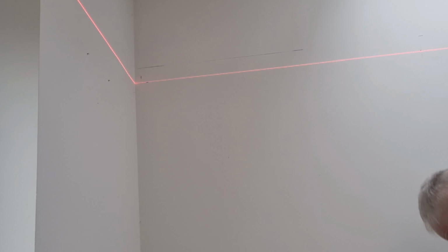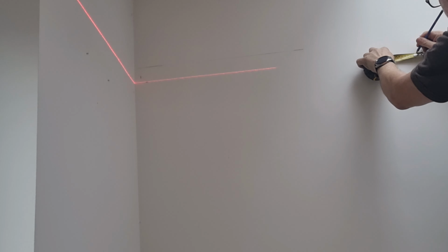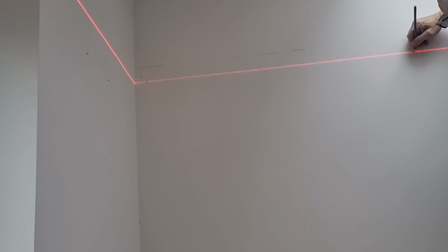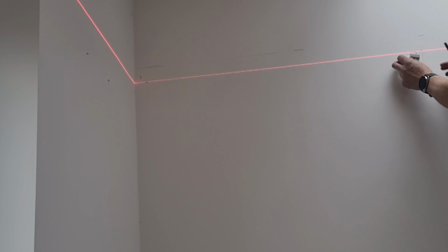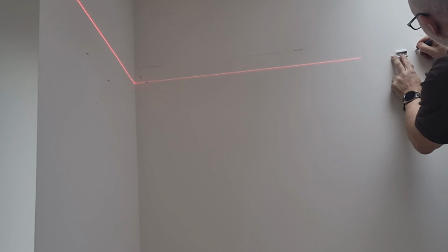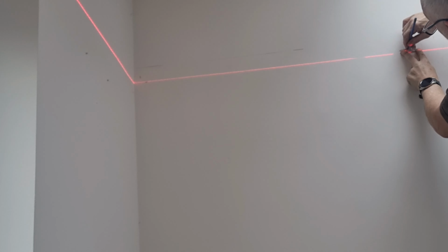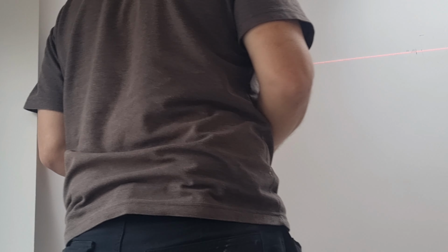That's the extreme far end of the unit, and then we'll mark 18 mil on for the thickness of the unit. There. And that's the 57 mark where our hinge is going to fix to, not hinge bracket. Do you remember that hinge and bracket? Anyway, so we've got positions there where both the brackets are going to go. 57 was to the lower edge. And we'll mark a couple of holes there, and a couple there. With this, you don't have to be bob on either, because you've got the adjustables inside.